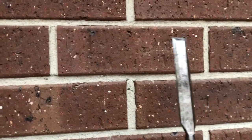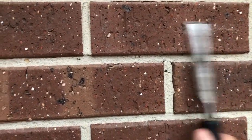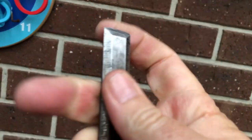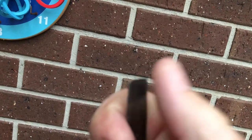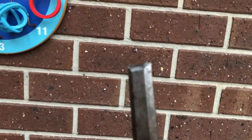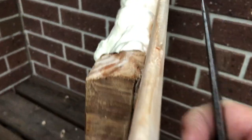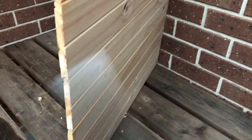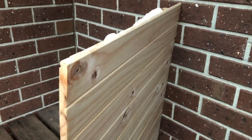The chisel being a bit blunt was actually good — it wasn't just cutting in and digging holes. But it was too blunt, so what I did was hold it up on the bricks and just gave it a bit of a rub on a rough brick on each side. And it went from really quite a dull edge to really quite a sharp edge — that's all it took. A little bit of concrete, a flat stone or a brick is all it takes to bring it up to a nice sharp edge again. So that's done with the tongue and groove. Now it's a matter of measuring out our exactly 61, marking it, scribing it, running a saw along, slapping a bit of stain on it, and then it's time to oil it.